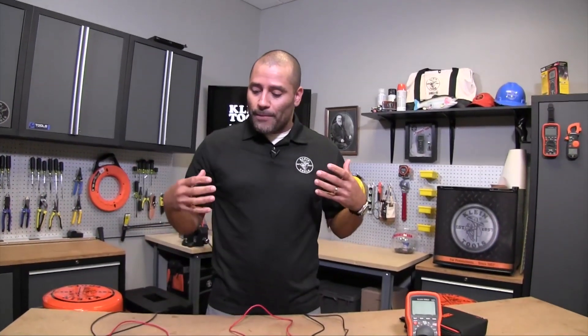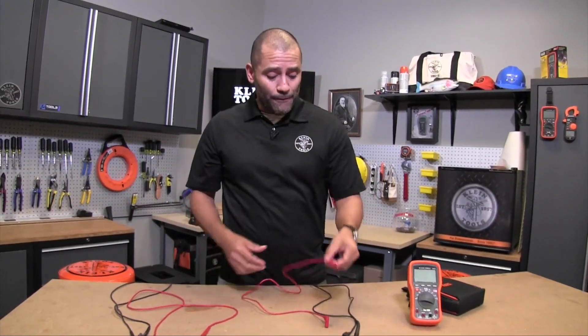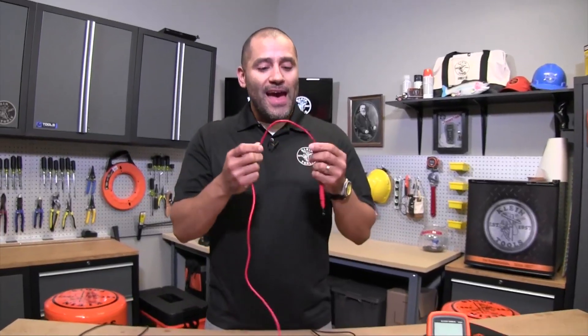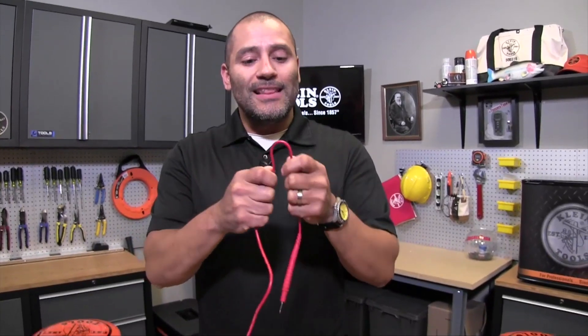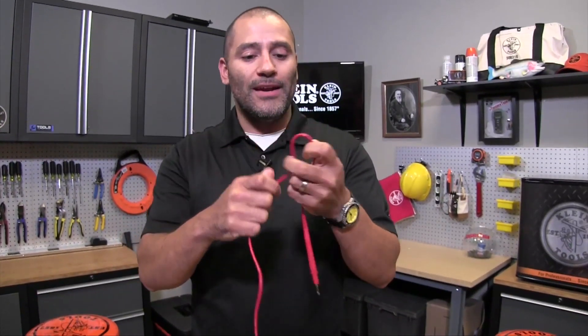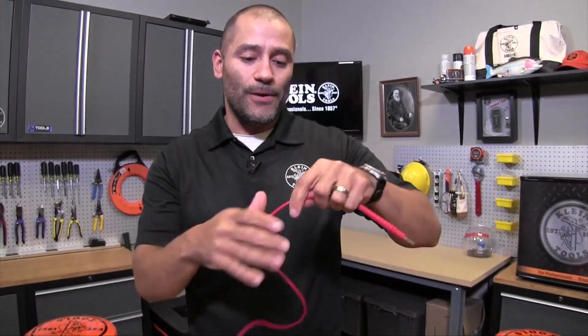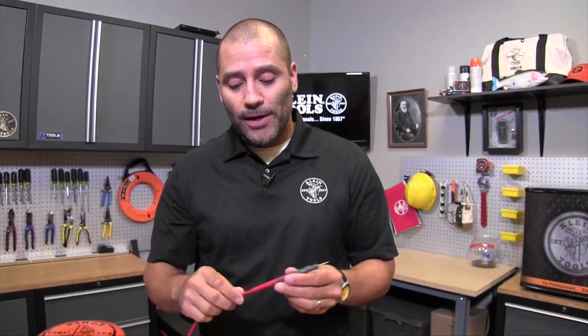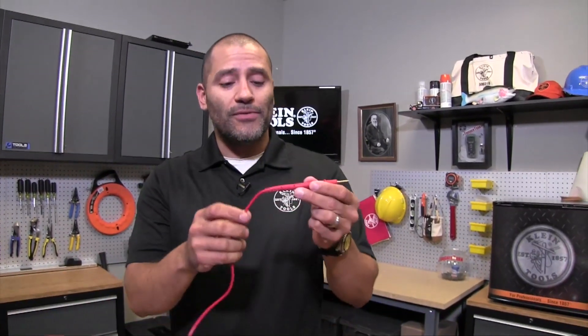Where does this come into play? For the most part it's not necessarily on the high end — it's actually on the colder side. For our local guys out here in the Chicago area, having a PVC lead out in the cold around 20 to 30 degrees means it becomes really hard to move around. It almost acts like it has memory — it'll be difficult to bend, difficult to move, and may actually become brittle. So if you're working outdoors in the cold, you definitely want a premium set of silicone leads.